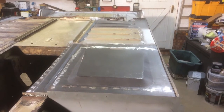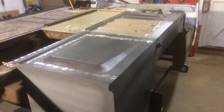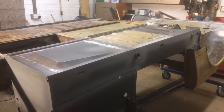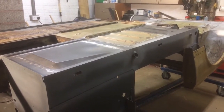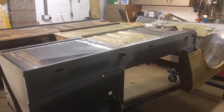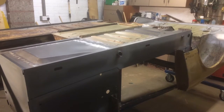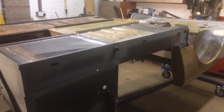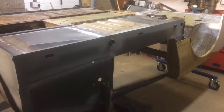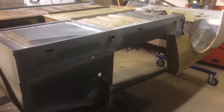The driver's floor and footwell are all finished now — it's all welded up and I've also welded the inner sill in place and fastened it to the side of the footwell. Before I did that I did quite a lot of work with the door in position to try and get the door gap better, and hopefully that's in good shape now. What I'll do next is fit the outer sill and at the same time keep an eye on the door gap.